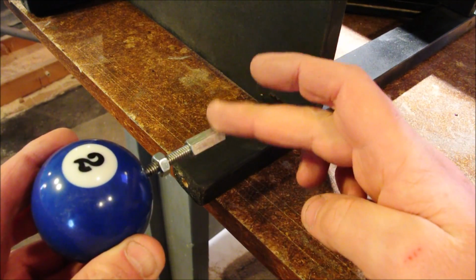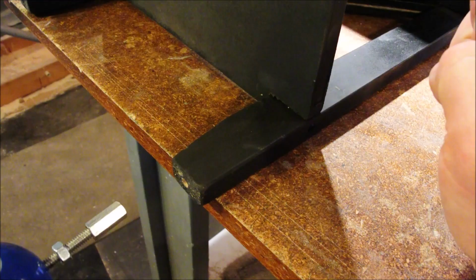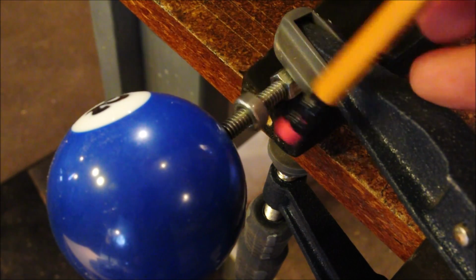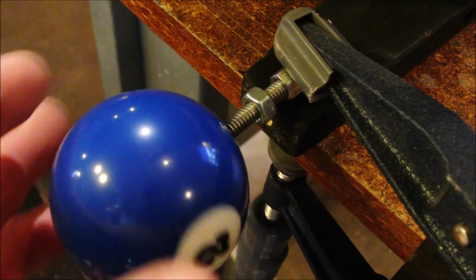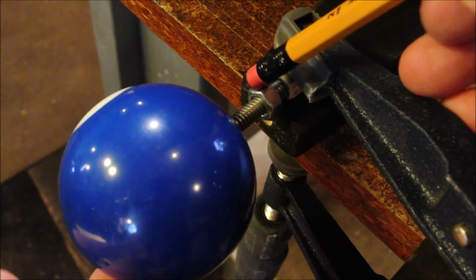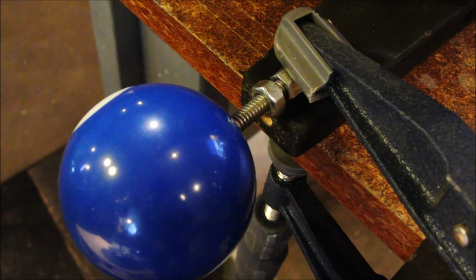But if I were trying to make the best possible piece of furniture, I would probably insert either a T-nut or a coupler nut into the leg itself. In addition, I would also have a nut on here to set it. And then the height could be adjusted for each foot by threading in and out, and then tightening the nut like a jam nut.